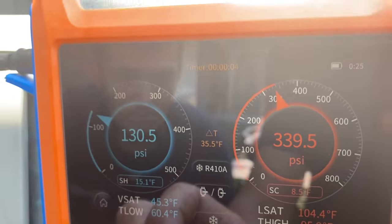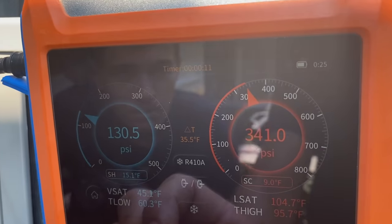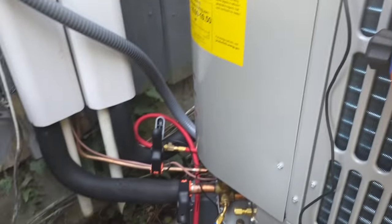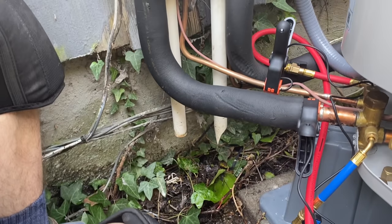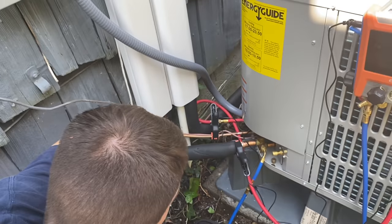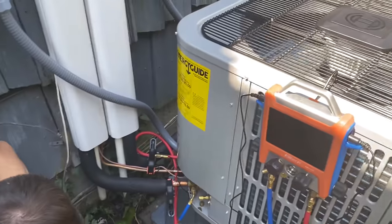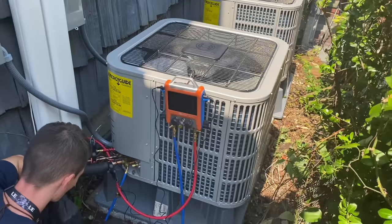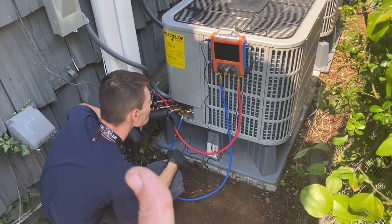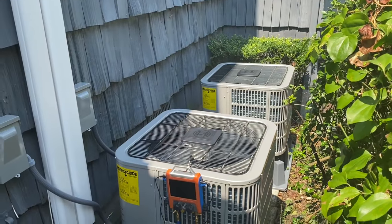Again this is a wellness check — both condensate drains are dripping over there. We never cut the end off this one, but it's all good. It may be a good idea to extend it and bring it to the bushes, but it's out of the way. The other one was right in front of the dryer vent, and that was no good. I admit my mistakes — we're only human. If you make a mistake, own up to it, suffer the consequences, and move on.